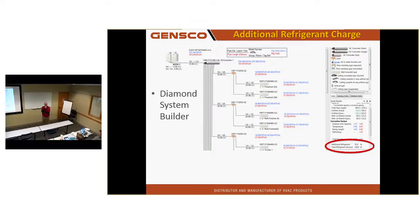No, we've been downtown fixing one of their piping jobs. Which one? I don't remember the building. I did a bunch of startups for Daikin when Hermanson did those jobs with RefLock. I saw all those leaks. I asked them what they were gonna do about the expansion of the pipe with some of these Y joints, and they said, what do you mean? He said, well, that thing's gonna do like this all day long. And pretty soon, you come back 3 months later, it's oil dripping out of those things. Yeah, that was a mess.